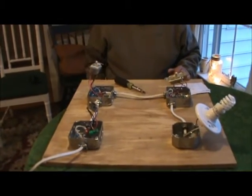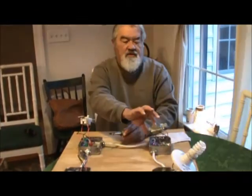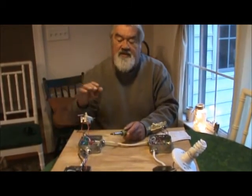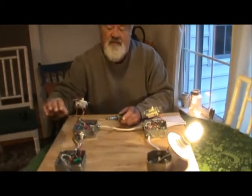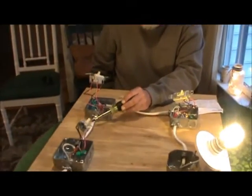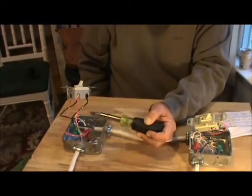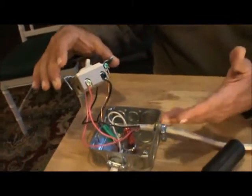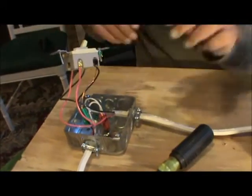If this is not working properly, I'm going to show you that in just a second. I've moved the wire on the four-way switch to show you what happens. Now you turn it off, turn it back on, and it doesn't come on. What's happened is I put the red and the black wire — coming from the three-conductor to the four-way switch — both on the same side, which is a common mistake people make. If you put them both on the same side it will not work properly at all.